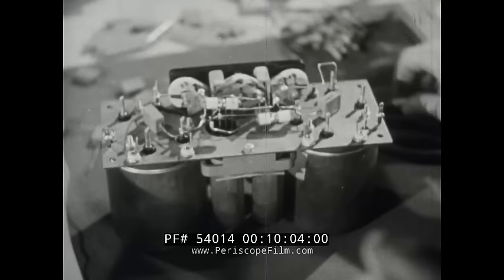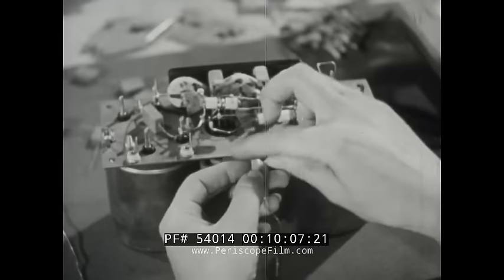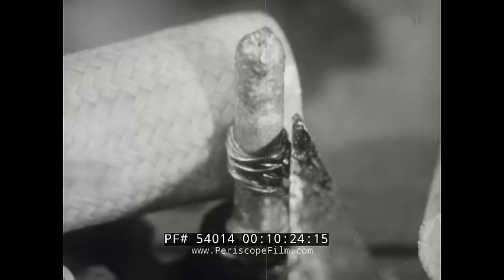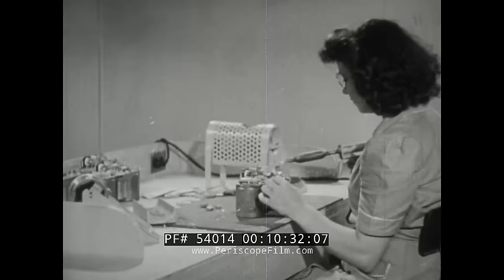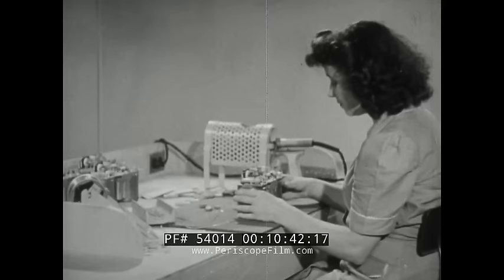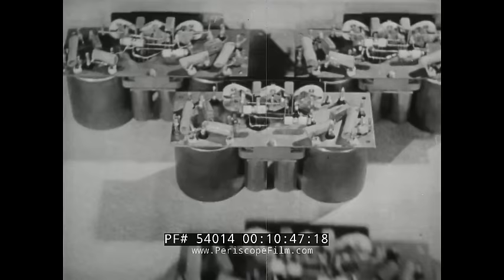The addition of these resistors with stranded wire leads will complete the circuit assembly. The resistors are slipped into the spaghetti insulation and anchored to the specified terminals. Wrapping the wire securely around the terminal assures a firm connection. In soldering joints like these, be careful not to melt or burn either the spaghetti tubing or the insulating material at the base of the terminal. Return the iron to its safety cage as soon as you are through using it. Then check all joints carefully to make sure none have been overlooked or poorly soldered.